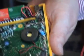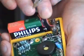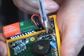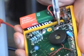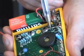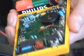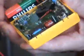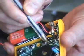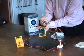The 10-amp fuse is not all that noticeable — it took me a long time to find it. It's actually a large iron bar. If you get approximately more than 10 amps going through it, that's going to melt. Any time you've got 10 amps going through a circuit, chances are something will break, or worse. So the 10-amp fuse should never go; if it does, something has seriously gone wrong. Quite often the milliamp fuses need to be replaced if you go above 200 milliamps.